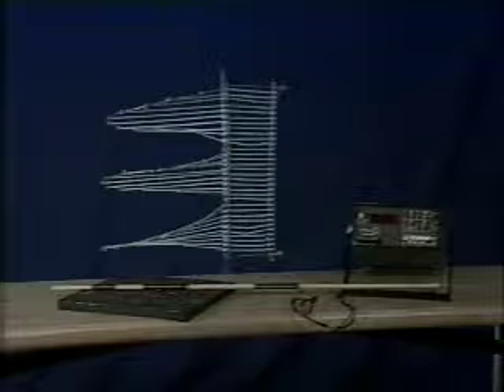The surface for a many-turn coil used in Faraday's law is geometrically complex, as the bounding contour to the surface follows the path of the wire. For a tightly wound coil, the magnetic flux linking this surface is the sum of fluxes linking each turn. Since the magnetic flux per turn is proportional to the number of turns, if each turn links the same flux, the total flux linked by the coil is N times the flux per turn. The coil self-inductance is proportional to the square of the number of turns.